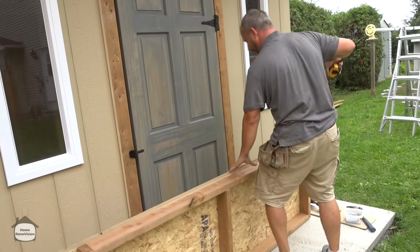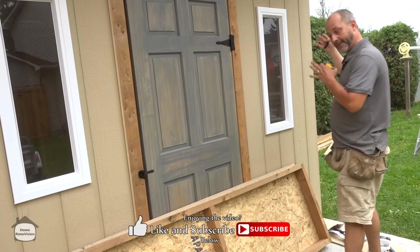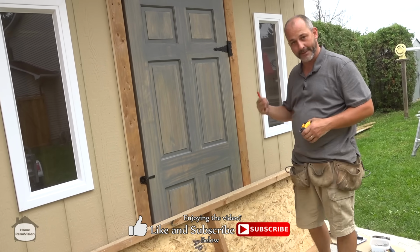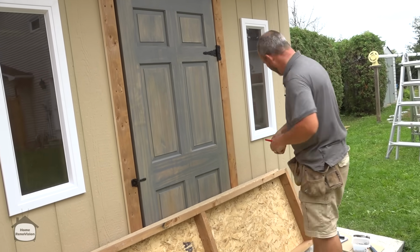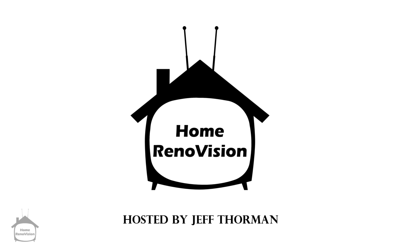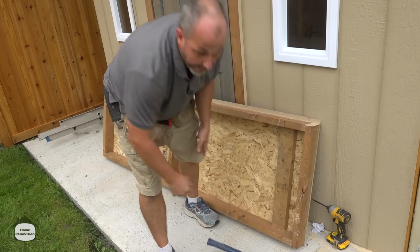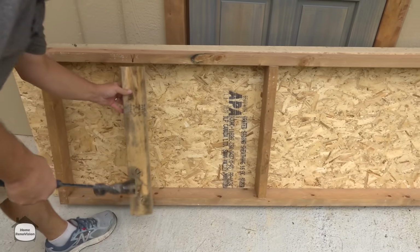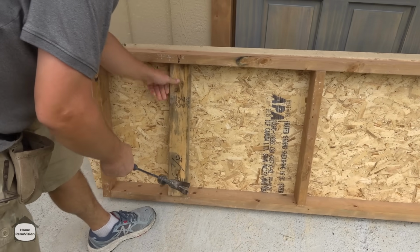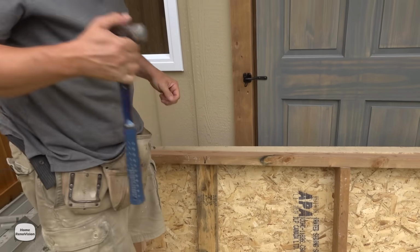6.5 and 65. So because we're using the same hinge system on the side door, and you can see both at the same time, it's important visually to make sure the hinges are at the same height on each door. So we will cut a couple more cross pieces here, and screw all that together, and we're good to go. Perfect. We need one more. That is why you keep your scraps around. Perfect.